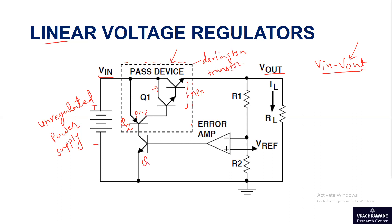This is another transistor — let's call it Q3. Then you have an operational amplifier, also called a difference amplifier or error amplifier. You also have two resistors R1 and R2 connected in series, so that at the midpoint a voltage drop is created, which is fed to the inverting (negative) input of the error amplifier, while the positive input is connected to an external reference supply.